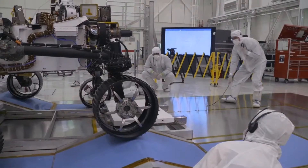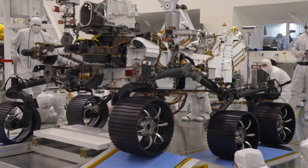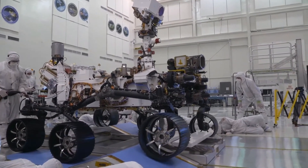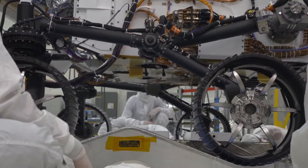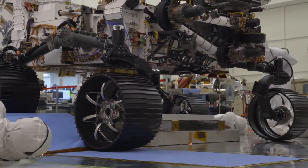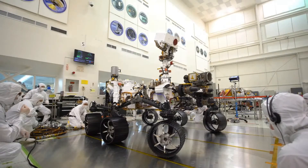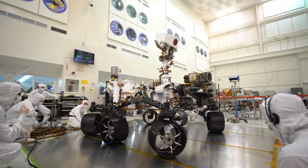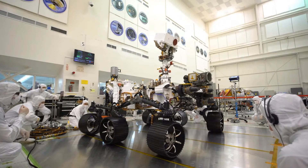So not very fast. And you'll see those arcs and those tracks when we get into a later picture of the first drive. The wheels are all attached to a rocker bogey suspension system, which has heritage all the way back to Sojourner. And even though Perseverance is obviously a much larger rover, we're still able to use it. With our suspension design, we can technically drive over rocks that are about one wheel diameter in height while still keeping the rover chassis leveled.